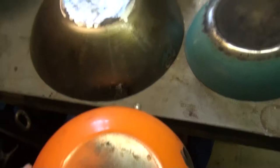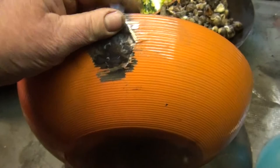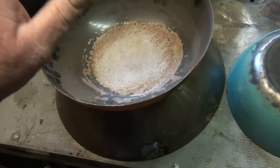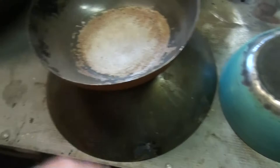One, two, three. So what I've done is I've broke the handles off, or ground them off, and then I've welded them in with a MIG welder. Yeah, I think it'd be quite difficult with a stick, but if you persevere, you can do it. Flushed it off. Then what I want to do is paint it white. Paint it with undercoat. So you paint it with undercoat underneath first, then stand them on some paint tubs or whatever. Paint the other side with the undercoat, and then you can put your red gloss coat on, then your white coat.